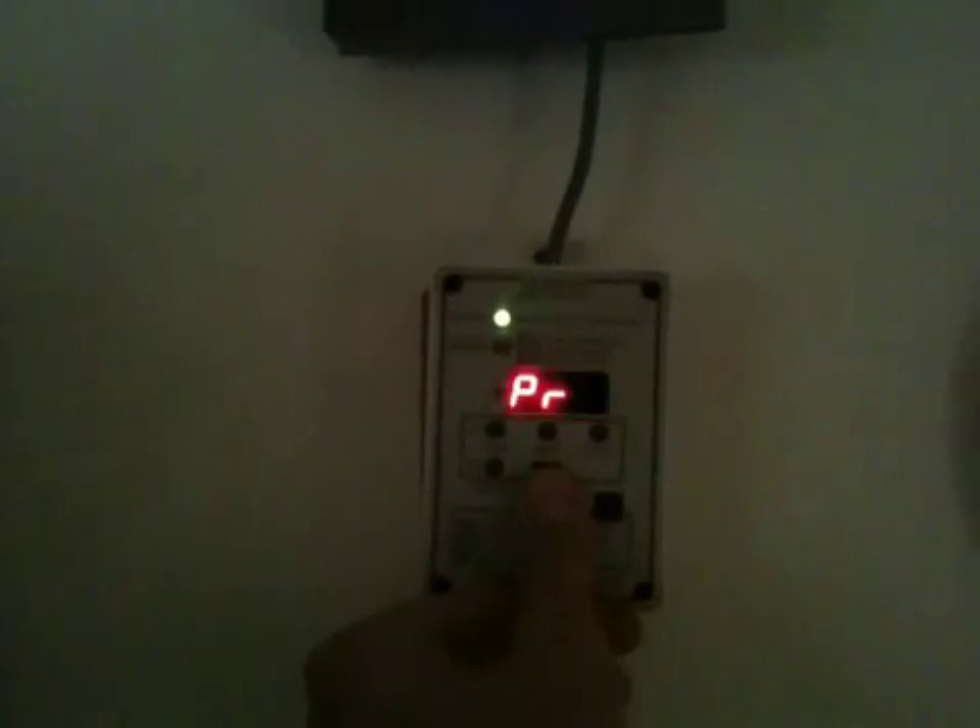I'm kind of having some issues right now. If you look back over here, you can see my inverter is charging. But as you can see over here, going through the menu, we're putting in 4.4 amps. Well, that's a 50 amp charger, but it's in trickle charge mode. So if I've got 18 amp hours left at 4 to 4.5 amps, I've got a good 3 to 4 hours left before I fill my batteries up, which is not very convenient. I think I need to change some settings on my inverter.